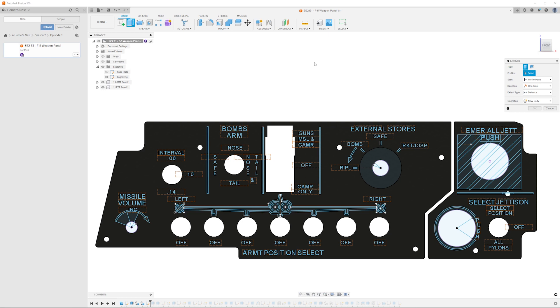I've just finished finalizing the graphics and the text and tweaking to make sure it looks great. But Fusion crashed — I lost all my progress. I had to redo it as well as the diffuser panel, so you're not going to see those just yet. Let's get into Fusion — press E for extrude and start selecting the different bits of text. I do this in a two-step process: select the text first and then select the graphics. Do them as two separate functions — it saves computing power and it's a fail-safe if you miss-click.